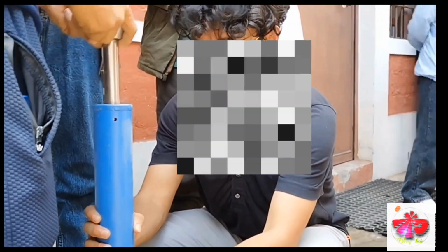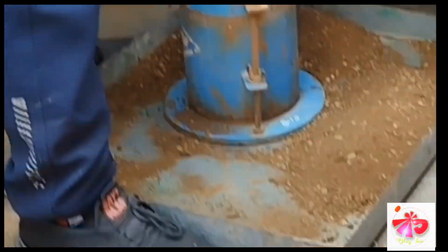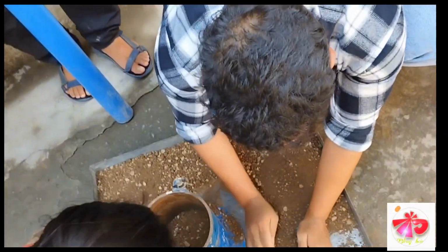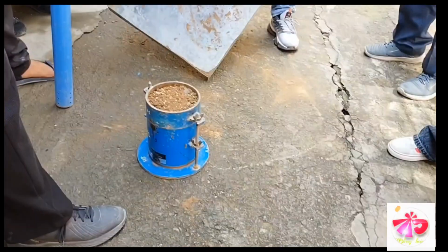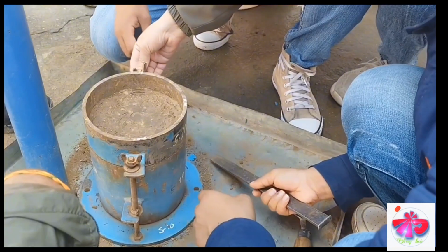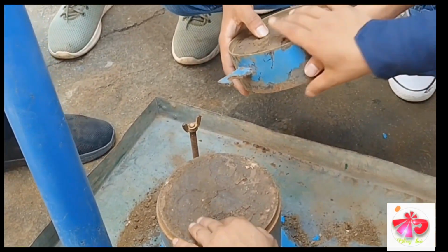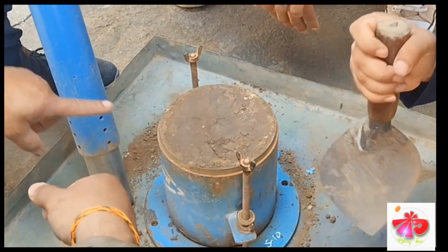Then the heavy compaction is done with the help of a rammer using 56 number of blows, having the weight of rammer of 4.89 kg. Fill the mold in 5 layers and adequately compact, having heavy compaction using a rammer of 4.89 kg. Then the top surface is trimmed off